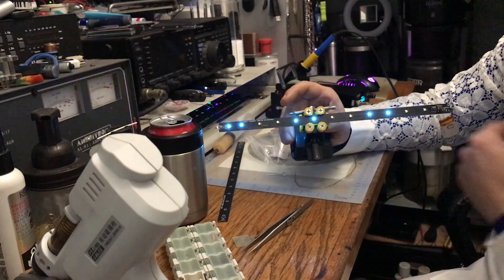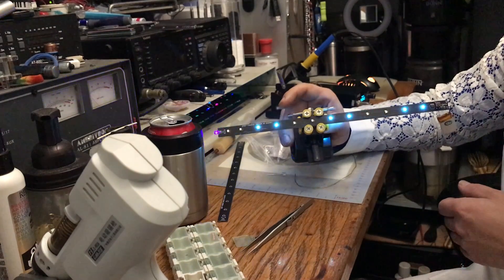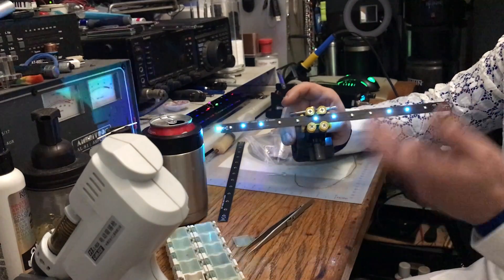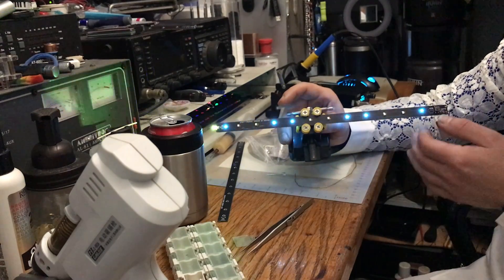This mode is pretty much a random lighting where all the LEDs are being multiplexed. Because it's multiplexed, it has reduced brightness — that's just the way this works. There's really nothing I can do to brighten them because the PIC-12 microcontroller only has so much output it can handle.